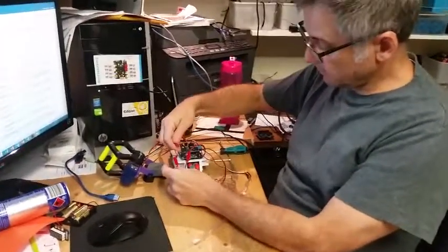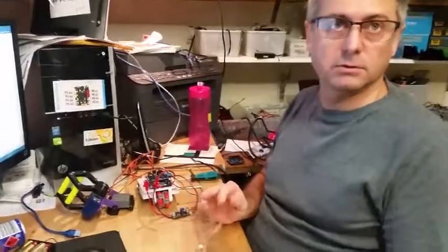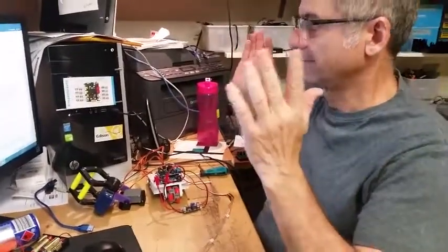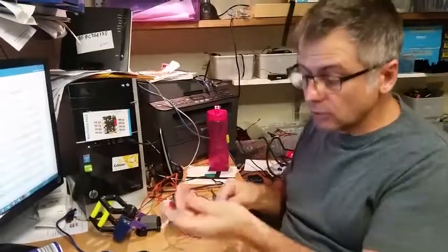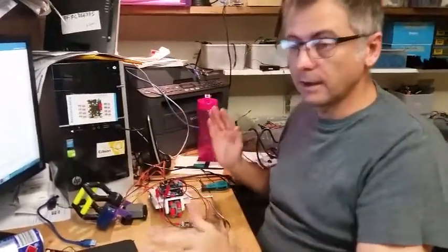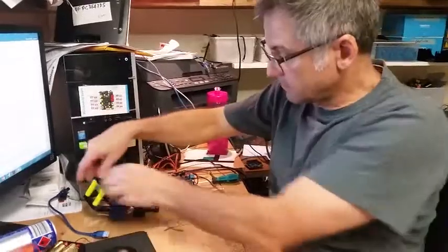The really important point is that it doesn't work properly if you do it in tethered mode. I don't know why — I'm not the programmer — but it always does all sorts of weird things in tethered mode. You can't control the servos if you're in tethered mode. But if you download exactly the same code, compile it, put it on the board, and then de-tether it, it works perfectly. So let's turn this on and open the claws up.